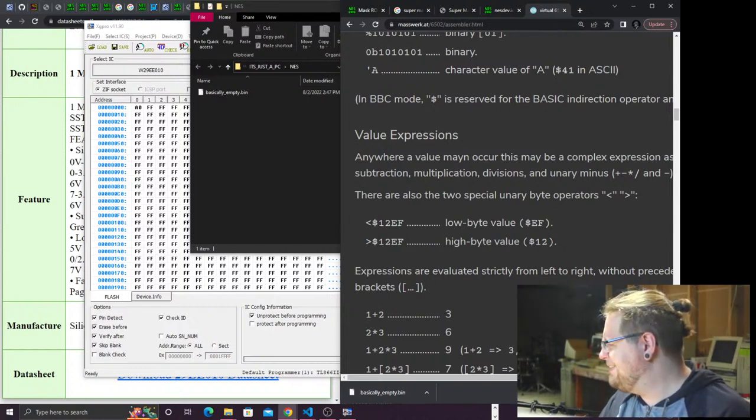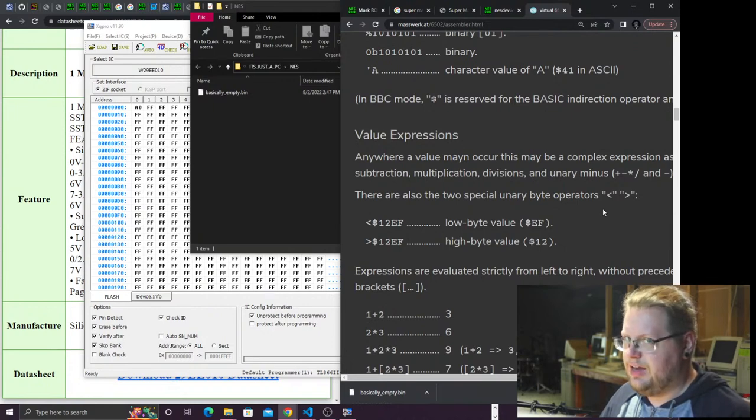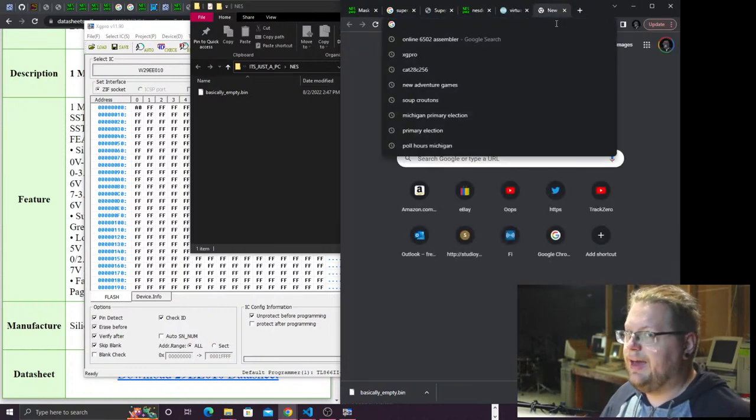Does the NES not have a BIOS on board, does it? I know an NES ROM image has a header, but I thought up to this point that the header is literally just for emulators. Of course, the NES being weird and having separate character ROM and program ROM and the mapper and whatnot, it needs a header to tell it where everything goes and what mapper emulation to use.